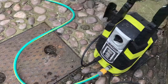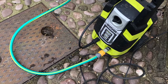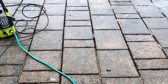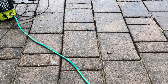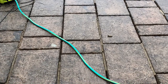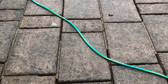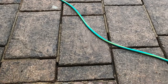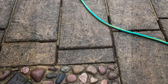I used the jet wash — the reason I used the jet wash is it makes life a lot easier. You can just spray in between the stones; be careful not to take any unwanted chipping off. Put a power jet wash on it and it will take the sand off, it'll take the concrete off, it'll take some of the weeds out. You might need to scrape some of the weeds out yourself, but that's not difficult. So I started doing this and it just made life a lot easier — jet washing in between each joint, each slab.